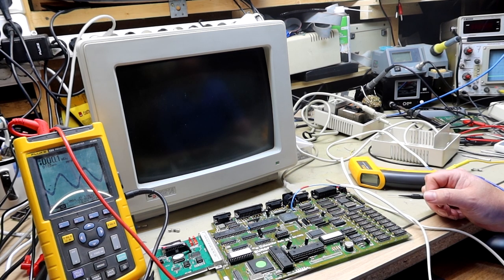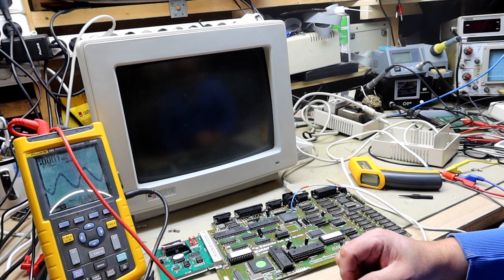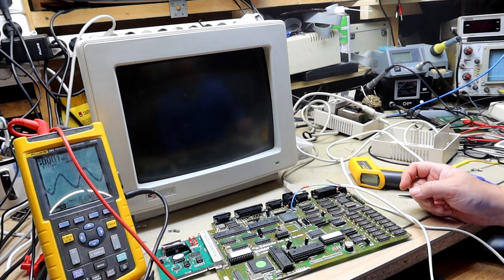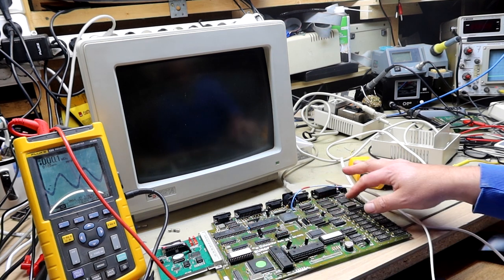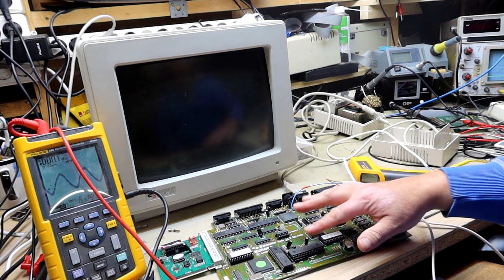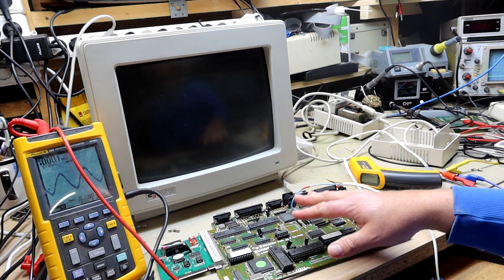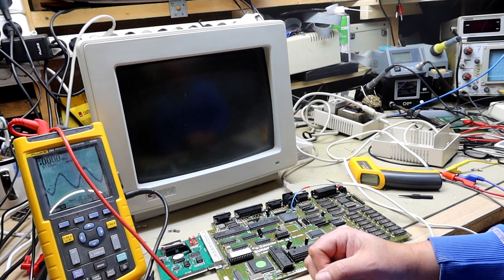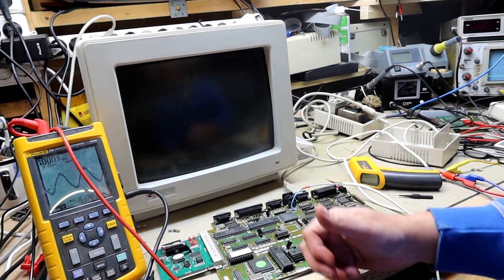This was a somewhat shorter episode. Finding a break in one of the vias on this board is very time consuming — I need to make schematics and cross off each line as I measure it so I don't miss anything. I have confirmed: the main crystal oscillates, the floppy controller crystal operates, the CPU is getting clock, and the external oscillator circuit is running. So something is trying to start. That's where we leave the Schneider Euro PC for part three. Hope you enjoyed — please hit like and subscribe to be notified when we continue, and see you in the next one.